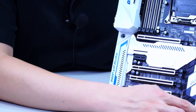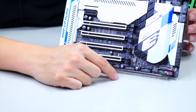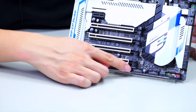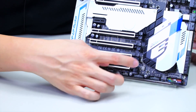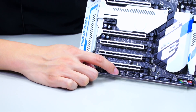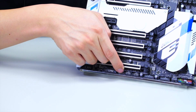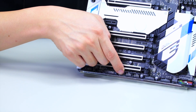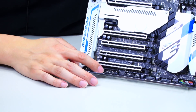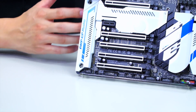As we move down the board, right here you can see we have our front panel pin headers, along with the G connector we showed earlier. We have system fans, 2 USB 3.0 headers giving a total of 4 ports, and another 2 USB 2.0 headers giving another 4 — so in this section alone we have 8 USBs capable of coming out of the front of the computer through onboard pin headers. We also have the LED control pin headers for Gigabyte's exclusive Ambient Surround LED.